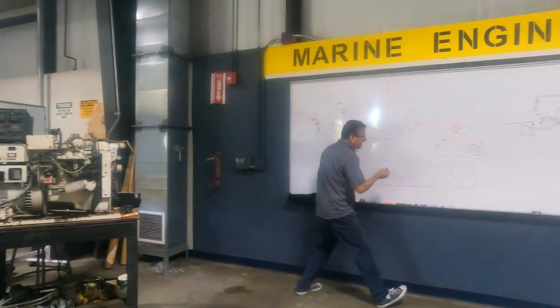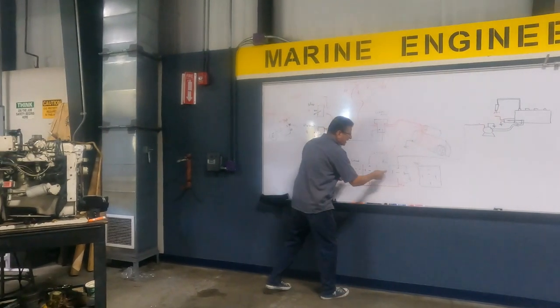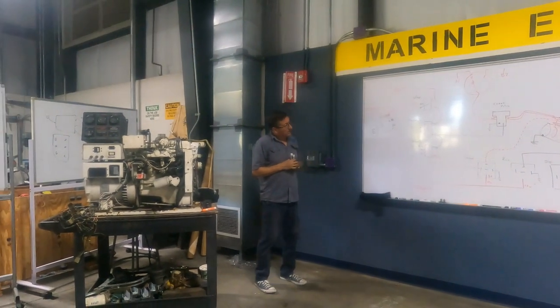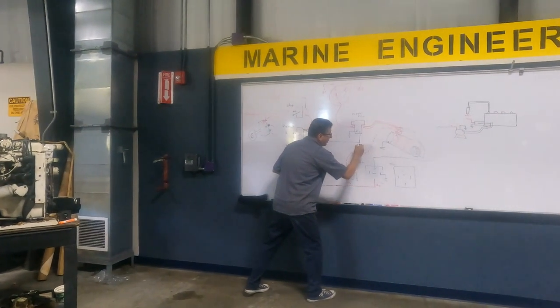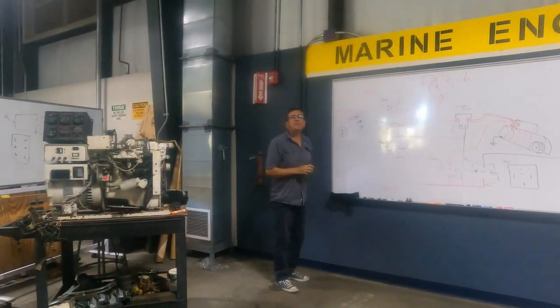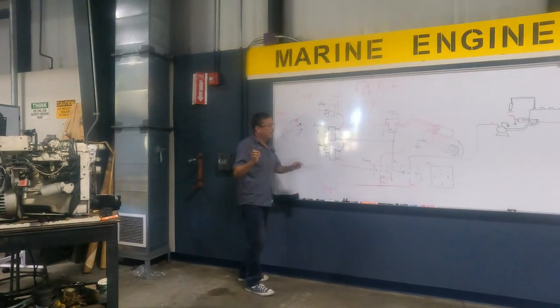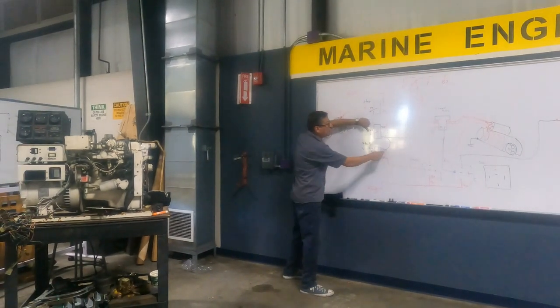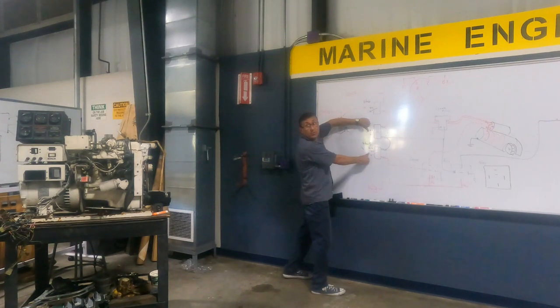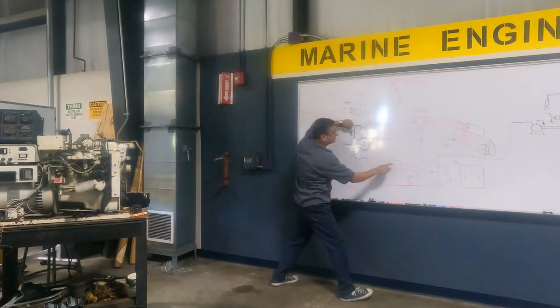This second relay, the run relay, is ground here and power here. This is for run. I am going to bring power with the same purple cable here. What is the meaning of that? Guys, follow me. I am going to start the engine again. Look, I press the preheat button, and now I bring current here. I press both of them at the same time. When I press this and this, I have power here, and I have signal here.